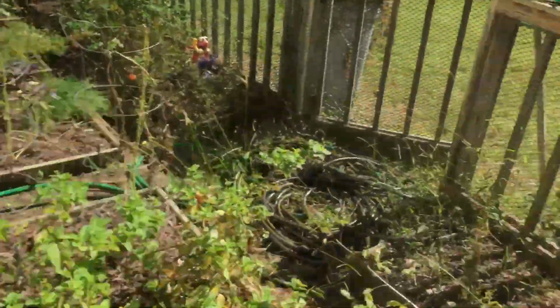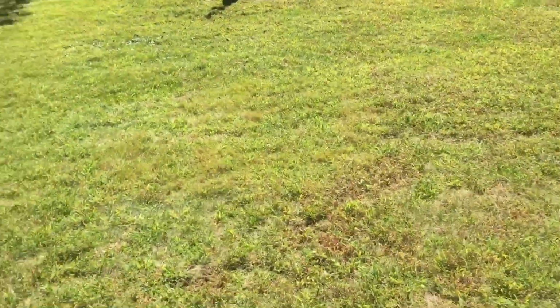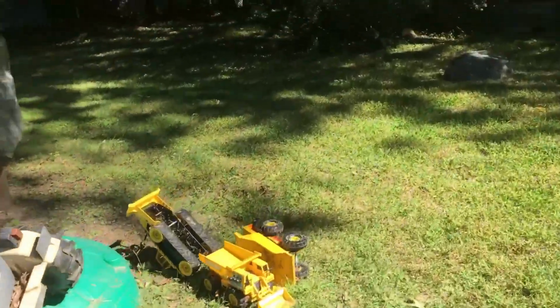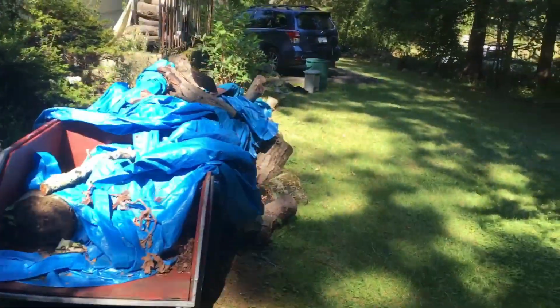So that's done. I reach my hand into that vent. It goes in about 2 feet. You can go in there with your arm, twist your hands left and right, and kind of clean out the tube. Now I'm gonna head in. I'm gonna disconnect the vent line from the dryer. We're gonna clean that dryer out in the back.